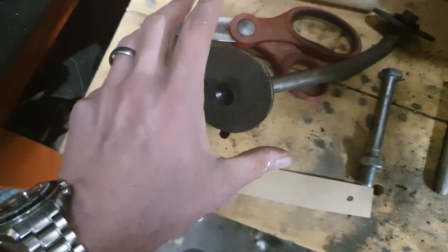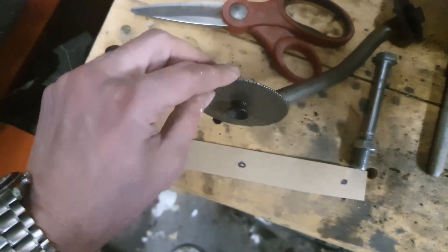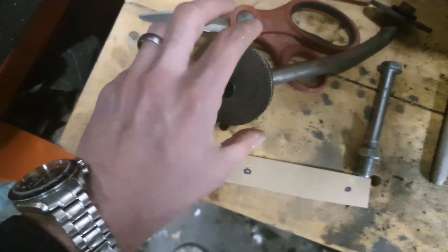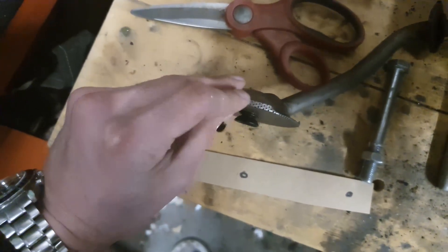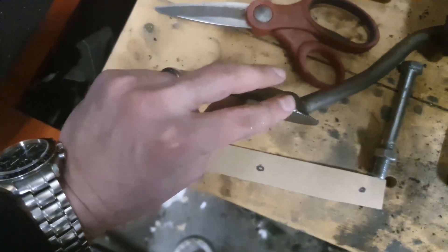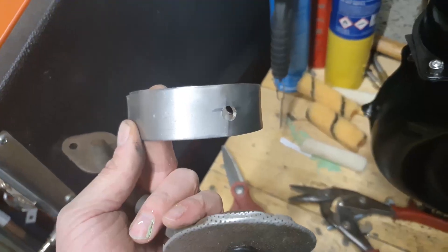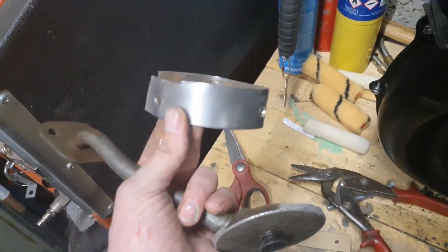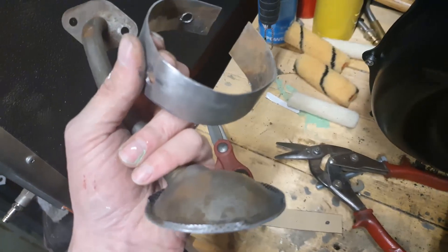It's not going to move around so it won't need a huge amount of really strong welding, but we'll tack it in a few places to make sure everything stays in place. I'm going to have to do quite a lot of cleaning first, as this is soaked in oil and that's really not good for welding. I have now drilled the holes and formed the basic shape.